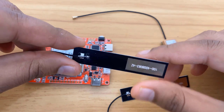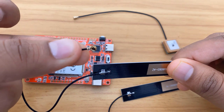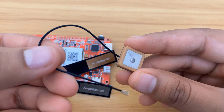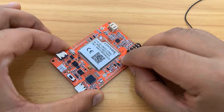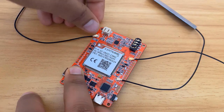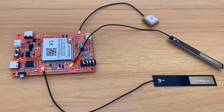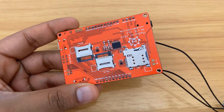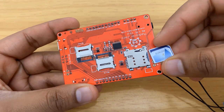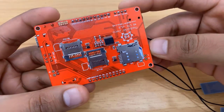These are the antennas — a pair of antennas for GSM, both having UFL connectors. The frequency is around 1800 MHz, which is the standard GSM frequency. This is the GPS antenna. Just insert both antennas and connect the GPS antenna. Remember: do not connect any antenna when the device is powered on, as it may lead to a short circuit. At the back side, insert the SIM card. I am staying in Nepal and I am using a 4G SIM from NTC — Nepal Telecom. I will just insert it by sliding it in. The SIM has been successfully inserted.